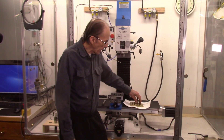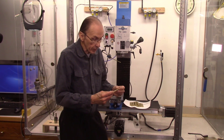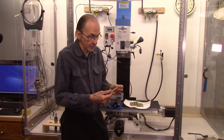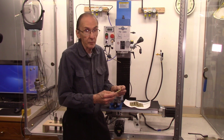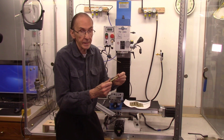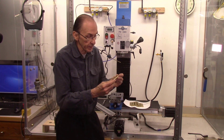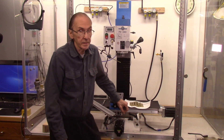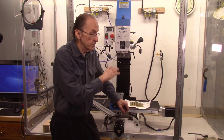I just finished making about 50 of these brass keys for the AccuSlice system using my CNC converted mill and the project went quite well. I made a few mistakes because I'm still learning how to use the system, the software, and how to program it, but overall it worked very well and I got some really nice parts. These threads are amazing — you couldn't do that nice a job by hand tapping or other techniques. They're clean, straight, and there are no burrs — they're beautiful threads. This was all done using the Acorn software from Centroid and this CNC converted mill.